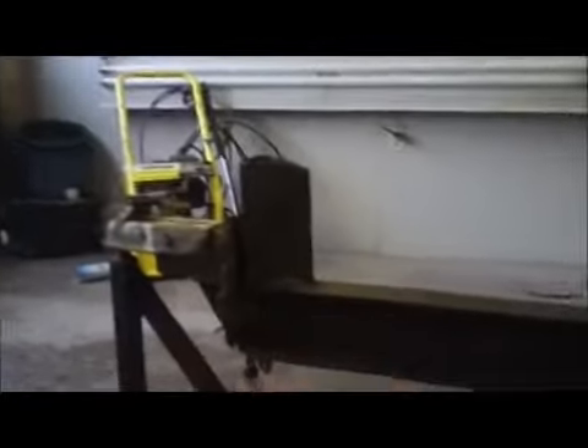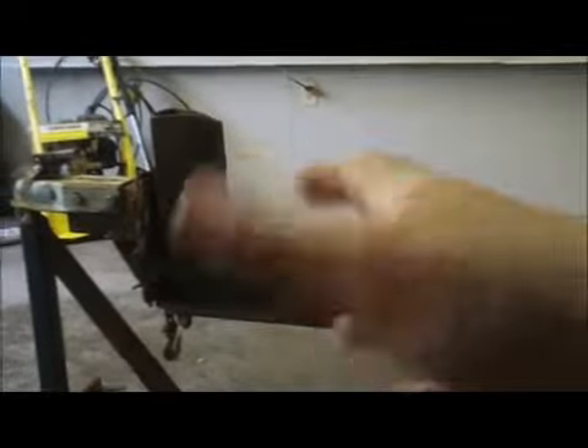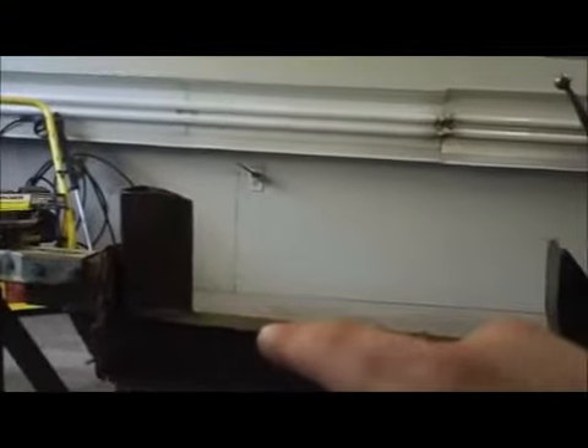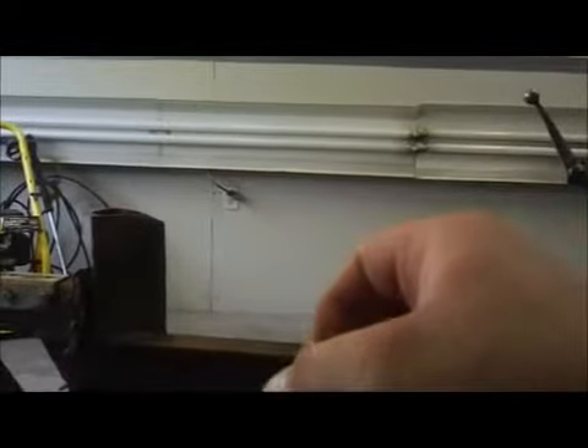The other thing I'm going to do — at least on this side, I'd like to do both sides — I'm going to build some type of removable table here. That way, when I pick up a big log, I don't have to hold it in mid-air as I'm splitting little pieces off the side. I can have the table support the weight of the log, make it a little bit safer to use. With a big round, you've got to hold the log with one hand, balance it on your knee, split it, then set the big log on the ground, go back, and pick it up. If I have a tabletop here I can just split and let it fall off the side and throw them on the pile.